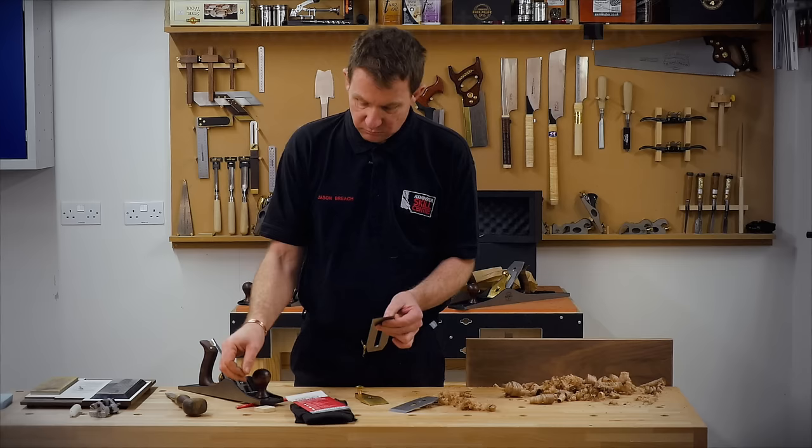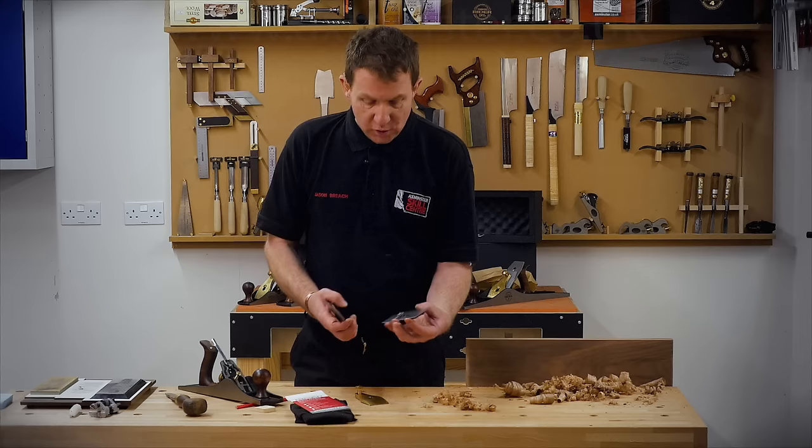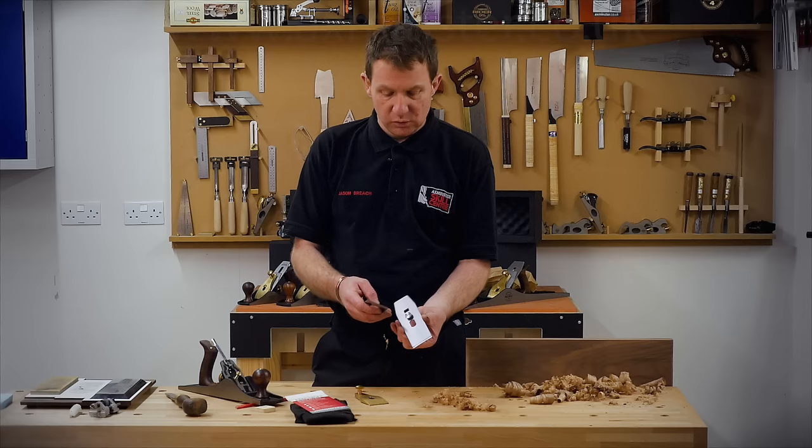It's pretty much already been sharpened, so it should work straight out of the box — we're going to put it back in and go straight off. We have a primary bevel of 25 degrees; the sharpened edge at the front is 30 degrees. The chip breaker is again three millimetres thick, inspired by the ones used in old wooden planes — a lot thicker.